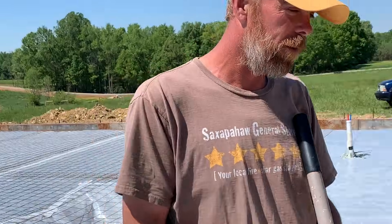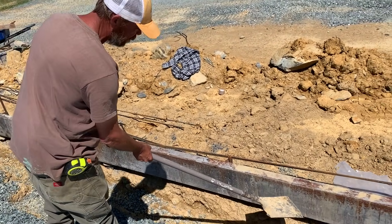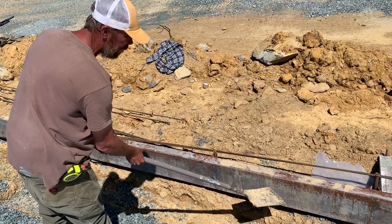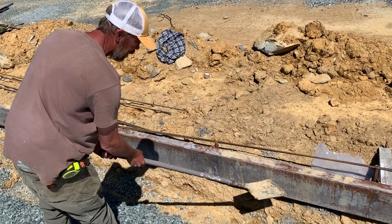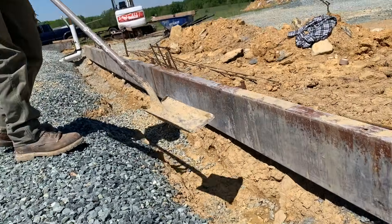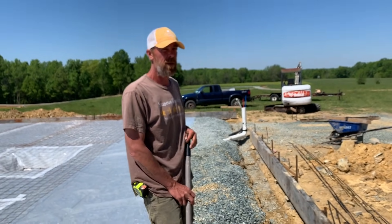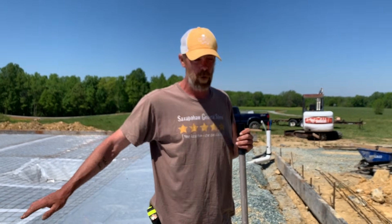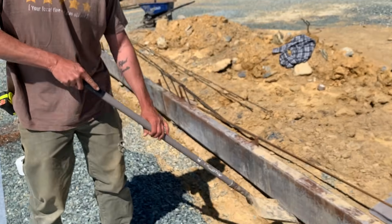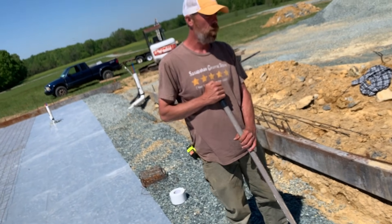We're going to pour — if you can look here on the form — we're going to come around with really, really tight concrete and a low slump, maybe a three and a half to a very tight four inch slump. And we're going to pour it up just below, probably about six inches below the two inch floors. That stiff mud will allow there to be a nice pressure on this part. So the wetter it is, the more it wants to push; the drier it is, it wants to try and stack up on itself.